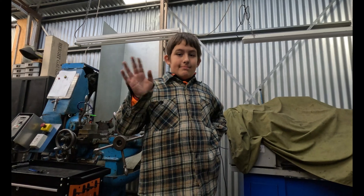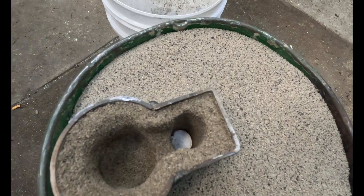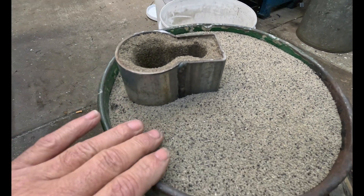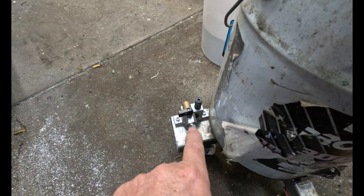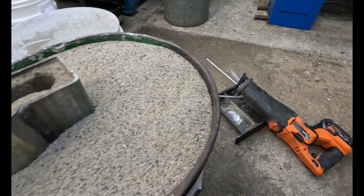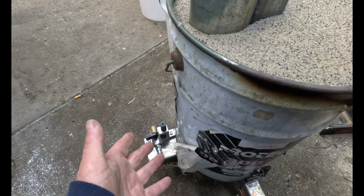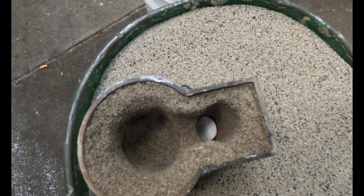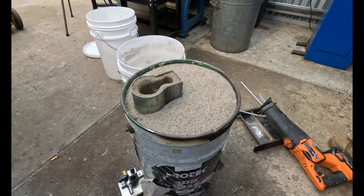There is my grandson Levi — he's been giving me a hand to set up our pattern in the sand. You can see down there the end of the foam sprue, and that's our cup, embedded down into the sand. I've got one of those little air vibrators but they're not much chop — you probably need about four of them to be really effective. I've just been laying my reciprocating saw across the top of this and it does a fantastic job. Also, don't adjust your sound if it sounds static — it's because it's raining on the roof. Of course it is, because you want to do a cast.